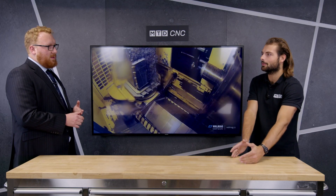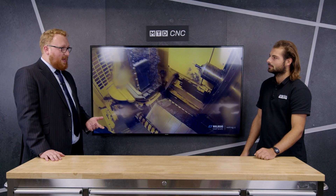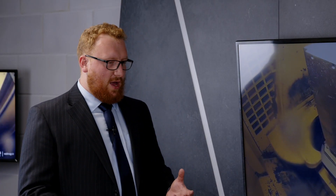The next one, electromagnets, require a constant current running through them. They're nice in that you're easily able to adjust the amount of grip force by adjusting the current going through the magnet. Does that come in the form of an extra controller box or can you control that via your machine? Both the electromagnets and the electropermanent magnets use a separate controller. You can either have that integrated into the machine or have it as a separate unit.